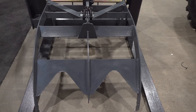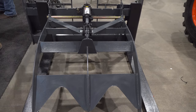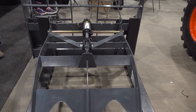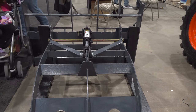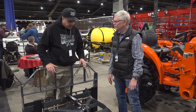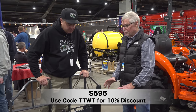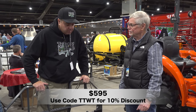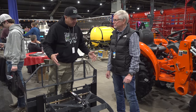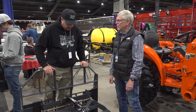So you're not adding a lot of additional weight to your forks to take away from your lifting capacity. You would think a compromise solution like this is kind of a grapple but not really a grapple — but you don't lose a lot. My forks and frame are 180 pounds total, so we're right at 300 pounds with that solution — that's not too bad. A lot of times with compromise there's an advantage. What is the price for this thing? This is going to retail for $595. You will need the third function hydraulic valve, but other than that, as long as you've got forks, this will mount right to it — no custom modifications whatsoever.